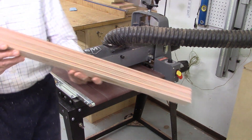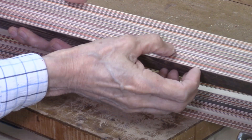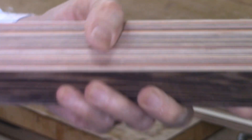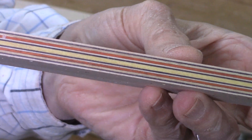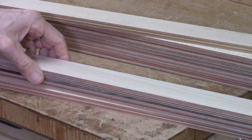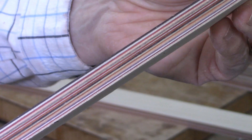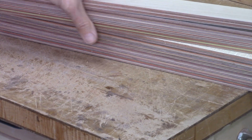This is the final board after planing and running through the edge sander and drum sander. I just finished the cleanup on all these laminated boards. This is my two inch thick board which I'll be cutting on angles for making my slanted knife handles. Here's another board I made for feature rings — it's symmetric top to bottom, about a half inch thick. Then I have three boards made for knife handles, again a half inch thick. So now I'm ready to proceed with my projects.